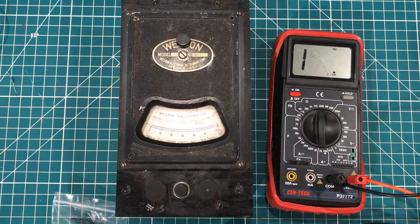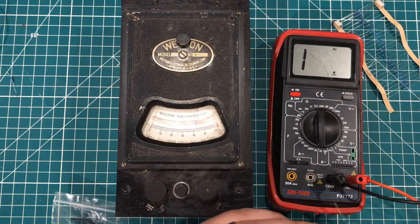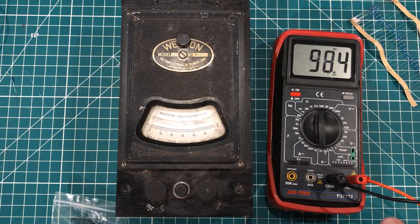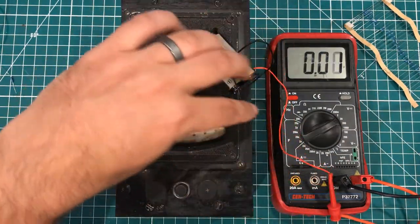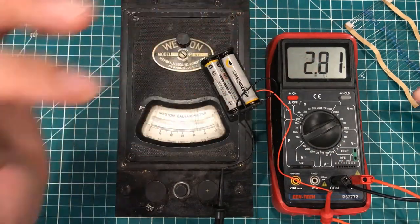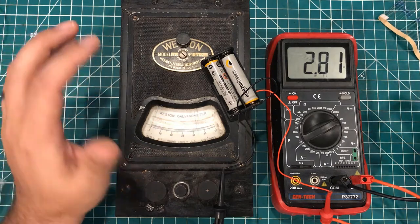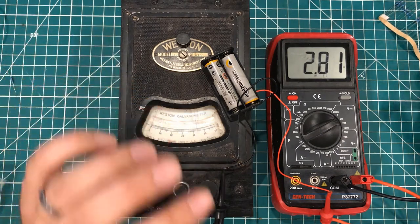If you're not subscribed to the Simple Electronics channel, you should be — he has a fancy rig for testing meters with super high-accuracy resistors. I have these AliExpress resistors right here. A hundred-K resistor is coming back at 98.4K, so good enough for our purposes. I've got some Amazon batteries and a battery box here. Hooking that up to the batteries, we are getting 2.81 volts. So you take the 98K resistor and just shy of three volts, and you should wind up with somewhere around 28 microamps on this thing. Let's see what we have when we hook up the galvanometer — I'm going to have to solder that resistor on. I'll be right back.